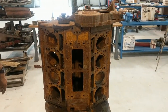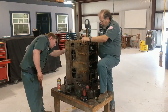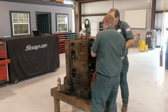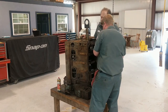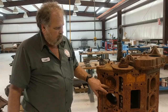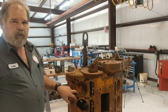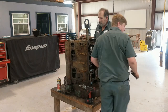These were all new pistons and liners — they're trash now. We'll see if we can save the cams; if not, we've got to work out the other engine. It's an old-style block just like the other one. Luckily the customer had a spare block, which saved him a bunch of money. What we did discover is that these liners are 20 thousandths instead of standard, so now we've got to reorder our parts to get 20-thousandths liners.